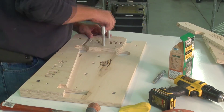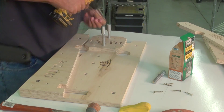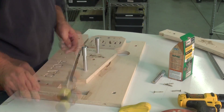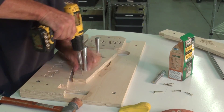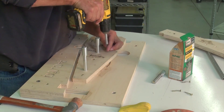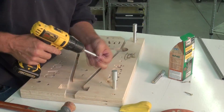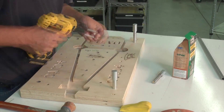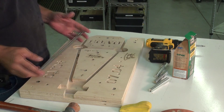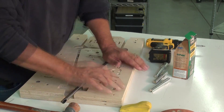To finish up the rest of the welding fixture, it's the same as what we did for the first part. Simply align the parts with the alignment pins and then throw in a couple of screws into each part to ensure that it won't move, then go on to the next part. This is exactly the same procedure we're going to use on all of the other welding fixtures — they all have alignment holes that ensure you get the part lined up correctly. It's very simple to assemble and easy to disassemble once you've finished that particular part of the welding.